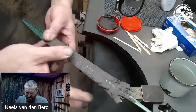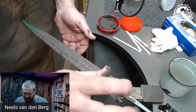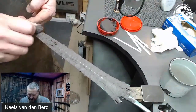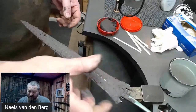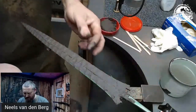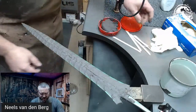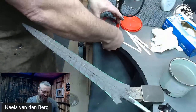As soon as you understand what the clay's function is — and that is to keep heat in specific areas — then you can go and draw your pictures if you want to. All I want is some of the stuff on the blade that's going to retain heat a tad longer. I still haven't decided whether I'm going to be doing an interrupted quench or just stick it in and keep it still. I'm just exposing my edge — I just need a thin layer. I see a lot of guys putting a huge thick chunk on, and you do not want to drop any of this and step on it because that is just going to annoy your wife.